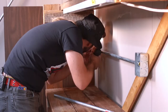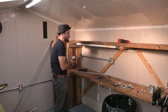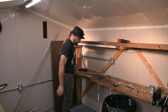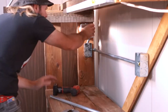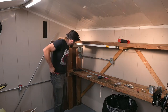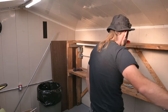That's loud with your head right next to it. That's not going anywhere now. Now that I'm looking at it, am I even going to have enough room to fit that offset joint in here? Just barely. That actually works out nicely because this thing's just a little bit over that way, and the way this offset is going to sit in there it's going to put this central. Tightening that up is going to be a challenge. Let's go ahead and hammer that box down. The wonderful thing about handy boxes is you can never get this in. Lock nuts and handy boxes — we'll have to test the ground bond. I can't get that handy box nut any tighter. Worst case scenario I run a ground wire between these two just to make sure it has a solid bond. There's a reason why you want those lock nuts tight — if you're doing conduit in this method, it is your ground wire.